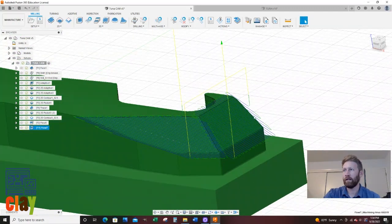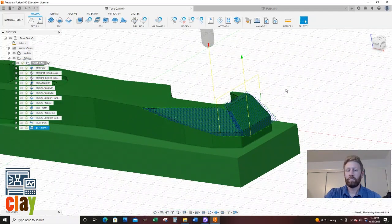You could go in there, since these faces, it's kind of dependent on that surface area of your step overs. So you could, if you wanted these to look more similar, reduce the number of step overs and break it up to doing this face, and then a second flow toolpath just for this face. But for our purposes, this will be just fine.